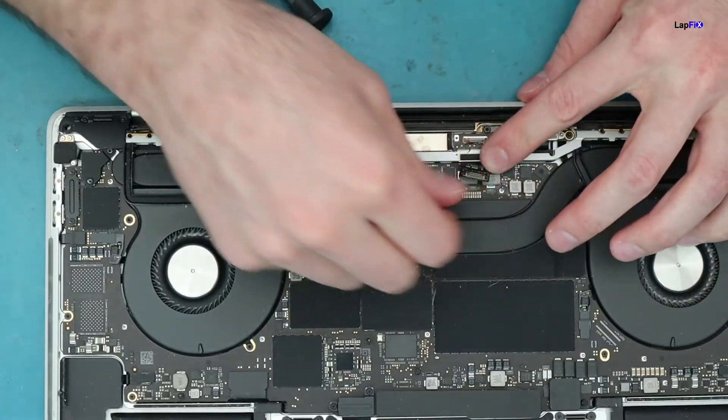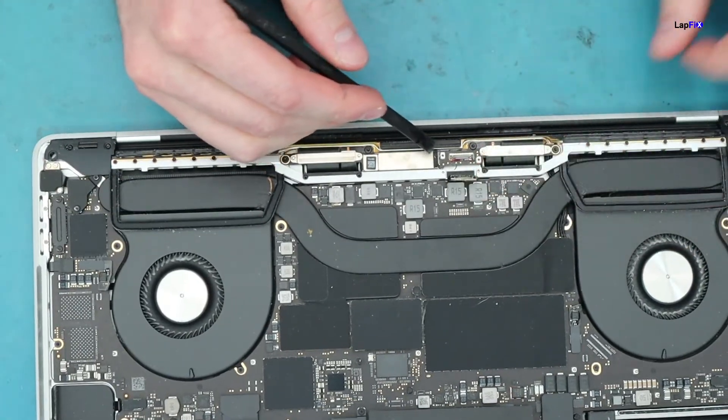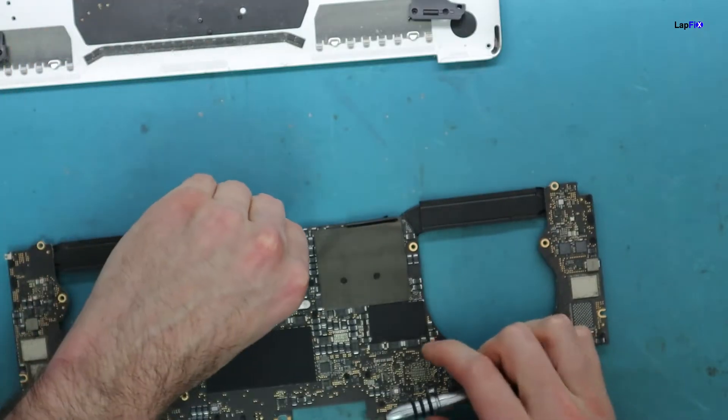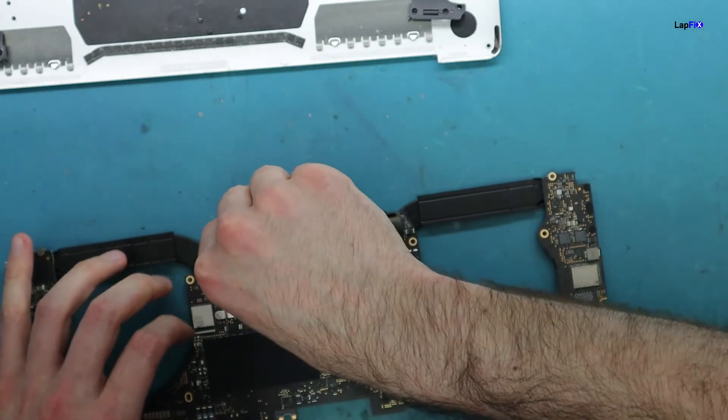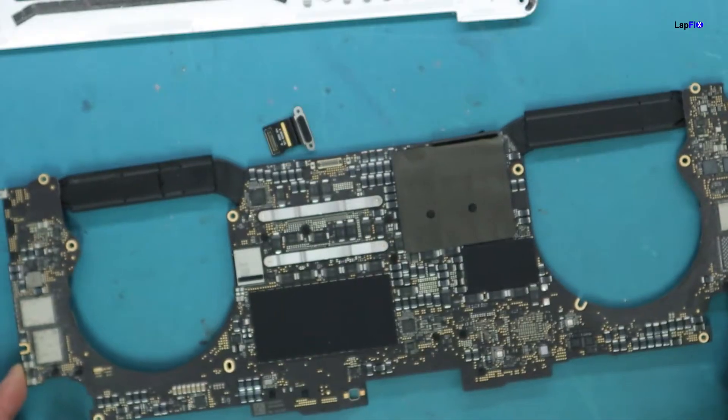This is really worrisome because the LCD on this model is very expensive — it's a 16-inch, it's a newer one, and they're not widely available. We really hope it hasn't impacted too much. When we uncover the casing, we notice there is liquid damage to the cable itself, as well as the cable that goes from the board to the LCD. That cable isn't too much of a big deal — if we're not able to repair it, they're easily replaceable. You can check those out in our store — link in the description. What we're really worried about now is the damage to the LCD connection itself.